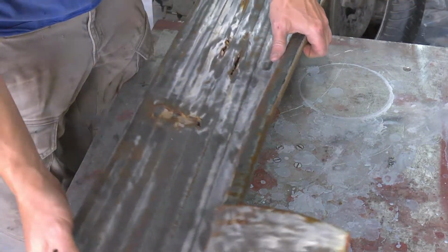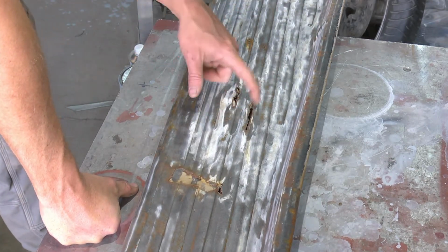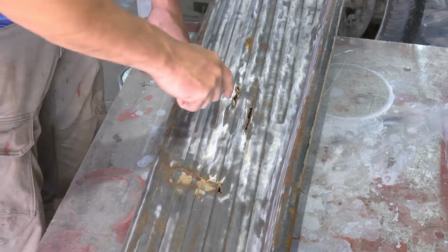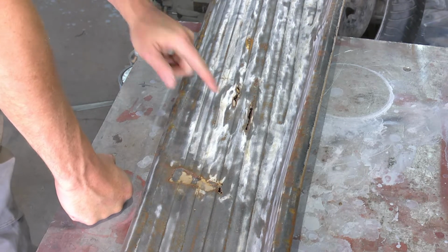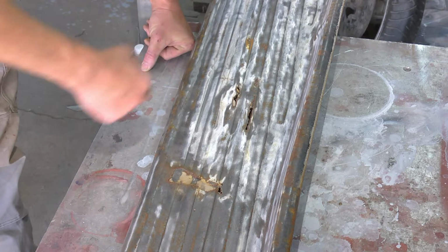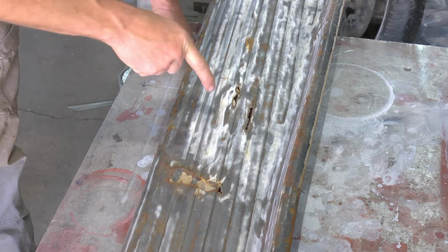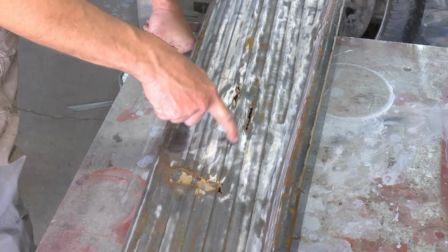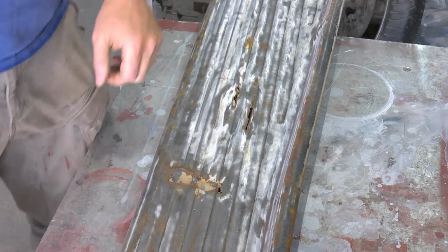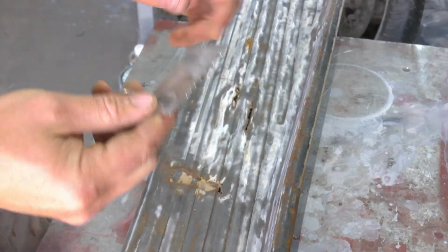You can see the inside through the hole here that it's really close to the edge of the brace, which is pretty normal. Our options are to try and surgically cut this area out without damaging the brace underneath, or go through and de-weld the brace, fix the area, and then put the brace back in. But when we get started, we need to know what material we're dealing with here. Handy dandy gauge finder.